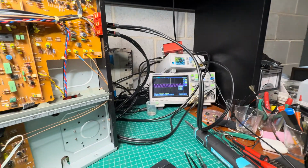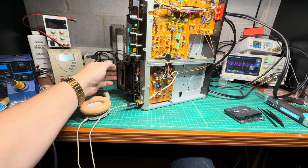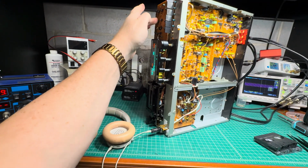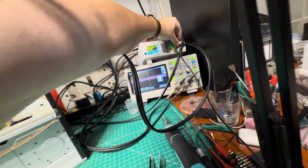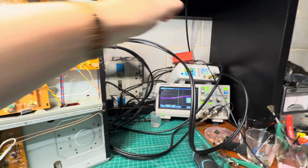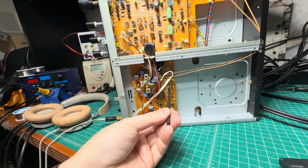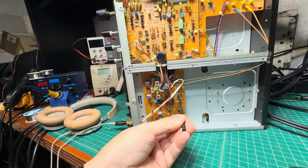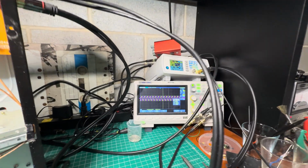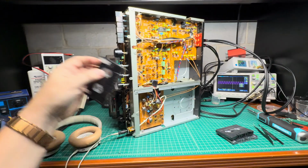All right, and the last one, metal tape. Let me see and adjust. Metal recording. 400 Hz proper level. Source, tape. Okay. 10 kilohertz. I have a reduced level. Adjusting right here. All right. You have a proper level, not in phase, but proper level. It did record on type 1 much better. It was in phase.